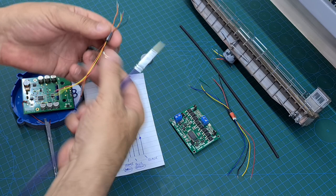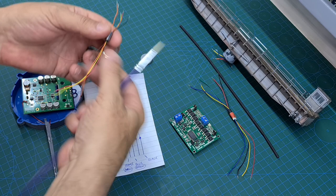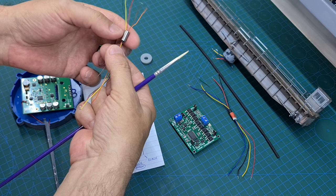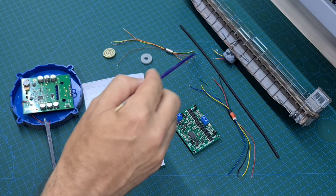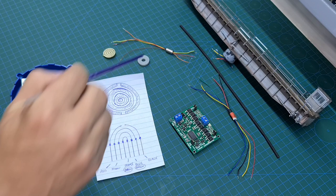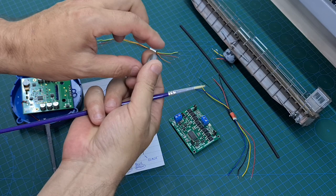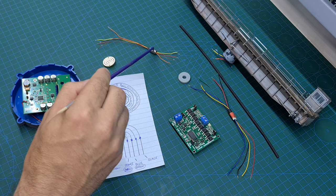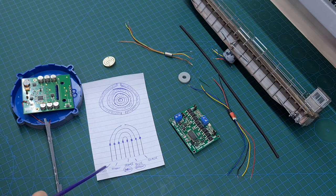The wires are attached to the slip ring and I've already done testing to make sure continuity between each of the corresponding wires - this unit is fully functional. You can see it rotates without twisting up the wires. I actually had to design this custom ring: the slip ring will fit inside it, I'll glue it, and then this ring fits up into the center of the bridge mechanism. That keeps it centered so the wires won't get tangled as it rotates.